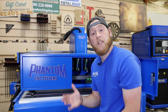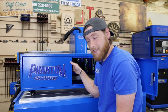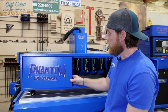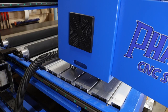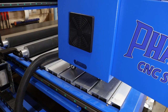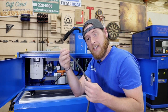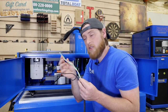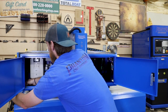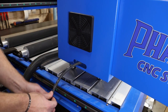What we're going to do first is wire up the actual control panel box of the CNC. We're going to open the cabinet and you'll see that on the left side of the control box there is a slit in the cabinet. Take your 10 gauge wire, strip off maybe 10 to 12 inches on the end, and feed it through the outside of that box and into the cabinet itself.